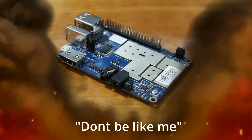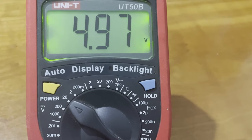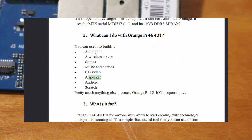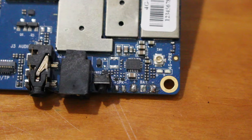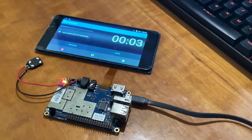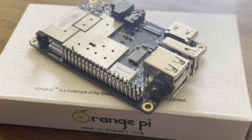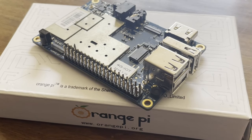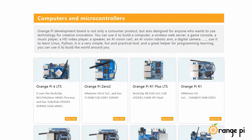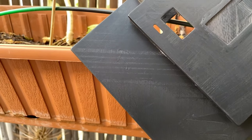And holy crap — take a wild guess what these solder pads do. It's a 5V output. Seems safe. Round 2: take a wild guess what these pads do — here's even a little hint from the official manual. It does nothing. And this isn't even a faulty device; I have 3 of these things that I've tested on. The Orange Pi is a cool little device, but just be wary — it's not quite as well-rounded as the Raspberry Pi, and certainly not as user-friendly. The Raspberry Pi is a lot more embedded in the education world, where this device feels more like a DIY hobbyist hacker-type device. Anyway, the moral of the story is: don't assume until you test — or in my case, don't model, print, and paint a case until you test.